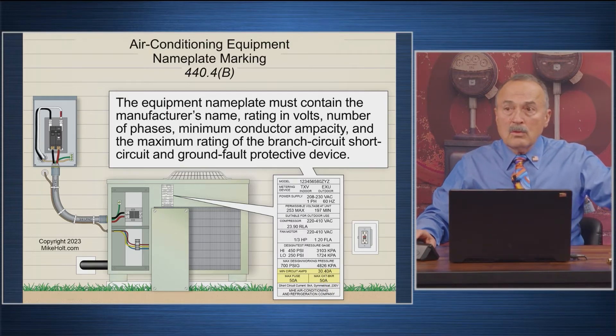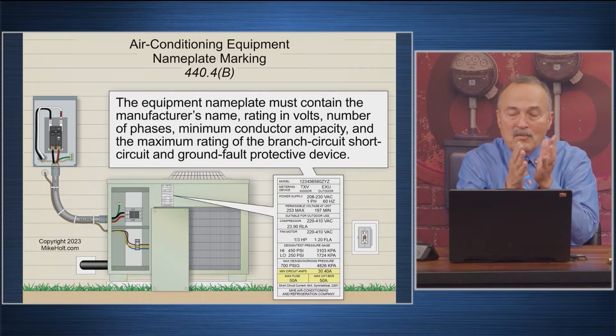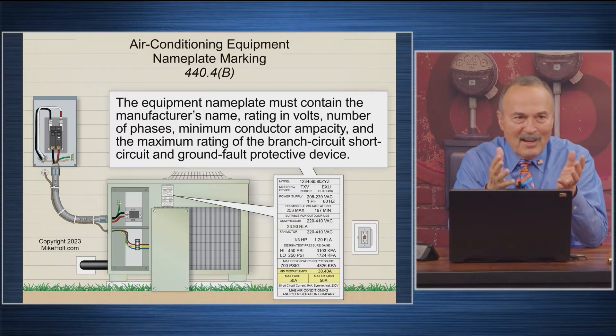And this is another thing that drives the old-school folks nuts. But Vince — you're a contractor, electrician, you're all of us, instructors, the whole deal. Is the 50 amp breaker going to protect the 10 AWG wire in case the wire shorts out? Is it going to trip the breaker? Yes, really quickly.